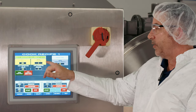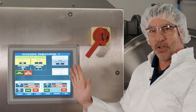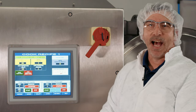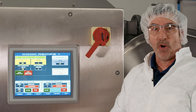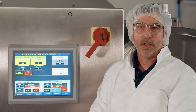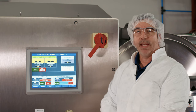At the end of the two to three minute cook time, the steam valve turns off and two open valves in the back drain condensate out of the system. This does two things: it prevents steam hammering in the jacket and helps cool the vessel faster by relieving condensate. At that point, the cook stage is complete and you can add the remaining ingredients.